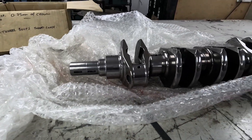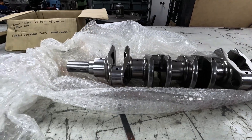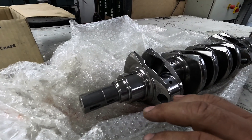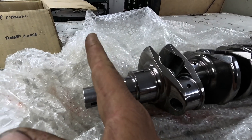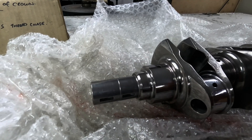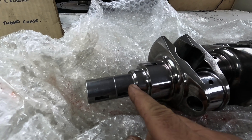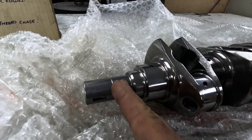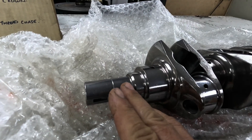The Millington crank that we super-finished for our friend Paul for his Mark II escort rally car has come back in. We've balanced it and super-finished it, but he's built the engine and the timing belt is 3mm forward on the crankshaft nose. When you look at the crank that came out of it - which was damaged and we still have here - this part of the crank has got 3mm machined off it. So I'm going to get this in the lathe, get it all trued up, and then machine 3mm off so his timing belt gear can slide back by 3mm.